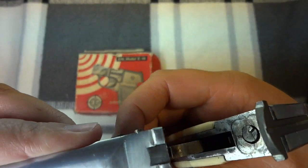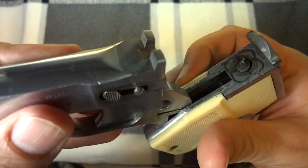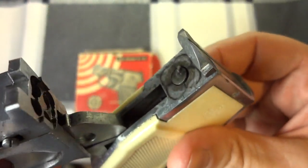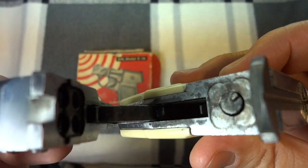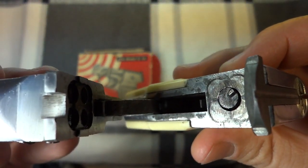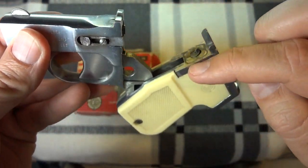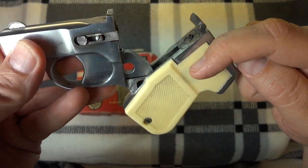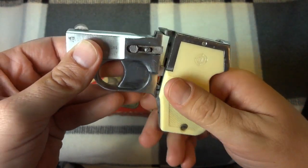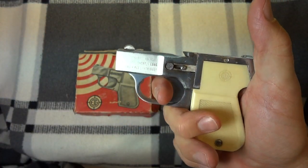Well, let me just demonstrate that. Well, I guess I can't demonstrate that rotating firing pin. What I can do is, and I don't mind dry firing it because no big deal. So you see, it's in the upper right. If I pull the trigger, what it does is it withdraws that whole firing pin assembly back here, and rotates at the same time, and then it lets it go. So you'll hear it. Well, there's also, it's a very long trigger pull.